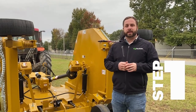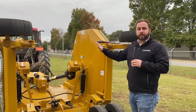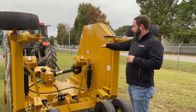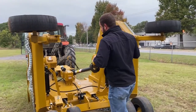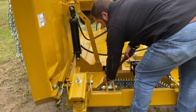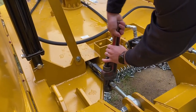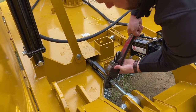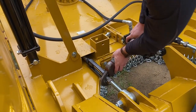The first step in setting up this ST180, when you first receive it, you're going to have your tongue pitched up in the front. What you have to do is turn these rear turnbuckles here to get that front tongue down level with your drawbar. You take a wrench, loosen your jam nut, and turn on it. If you turn it clockwise, it lowers it; counterclockwise, it makes it taller.